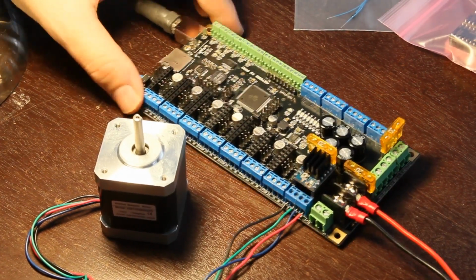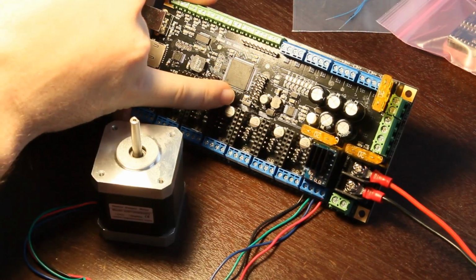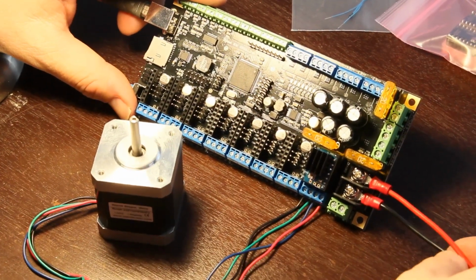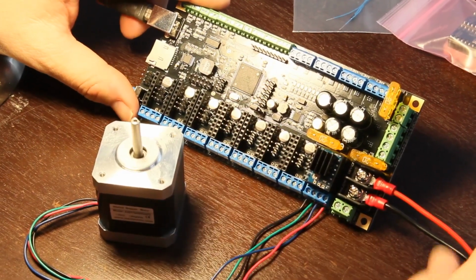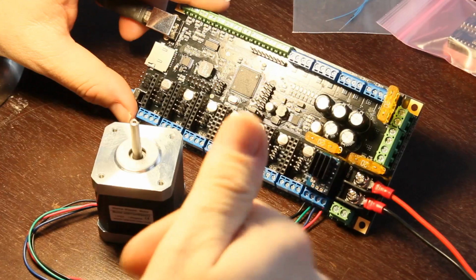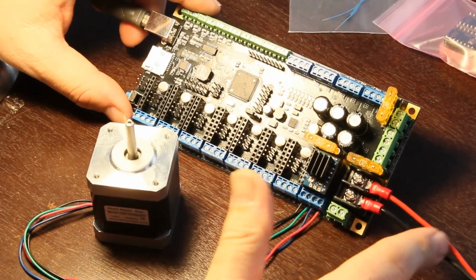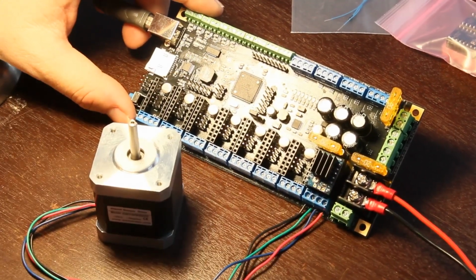One other thing worth mentioning here, there is a power select, and it claims that by default it's set to power off of the connectors here. It says INT and USB, and so I'm going to power up off of this. I assume this is INT. The wiki on RepRap actually says that it defaults to this external connection here, but I'm not seeing that on the board. So before I apply power, I'm going to swap that over. I've got 12 volts, not yet, but I'm about to have 12 volts on these cables here. So if you want to power it up without having this external power supply to do some firmware development or download, and you don't need to spin the motors, you can just power right off a USB. So it's a good feature.